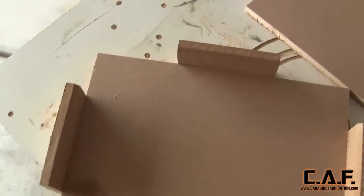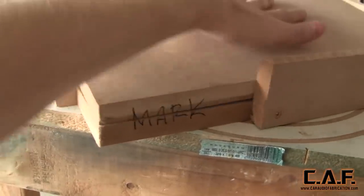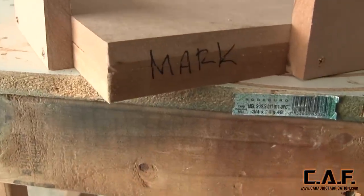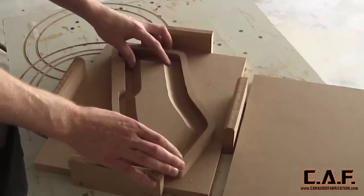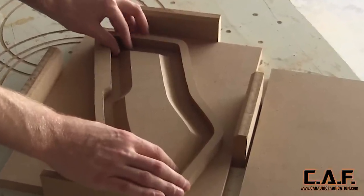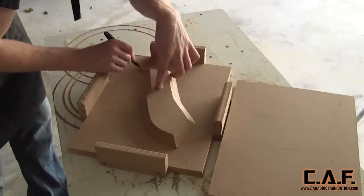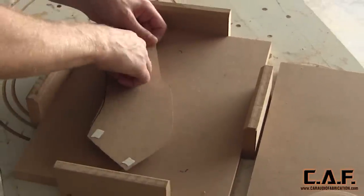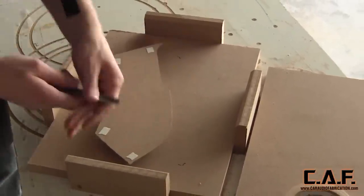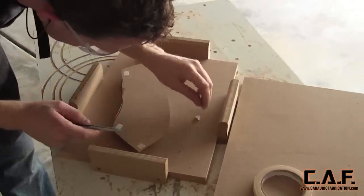With the woodwork complete we can now move on to creating the box which will allow us to press the material. This box features a top and bottom piece that have been flush trimmed to one another. It also has four walls that guide the top into being perfectly flush with the bottom. I wrote my name on it in this corner to ensure that I always put the pieces together exactly the same. I'll make small marks around the inside piece so that I know when I place it in with template tape that it's in a good position. I apply several small pieces of template tape to the back side of the inside shape in order to stick it to the bottom piece. Since I like to reuse my mold boxes I applied very little tape, otherwise it's very difficult to remove the template shapes.